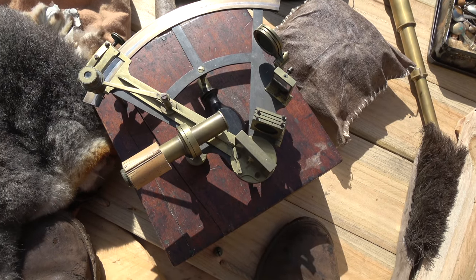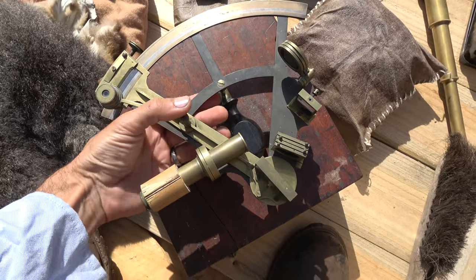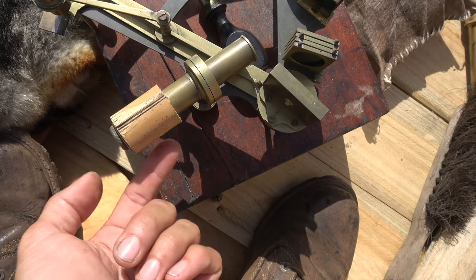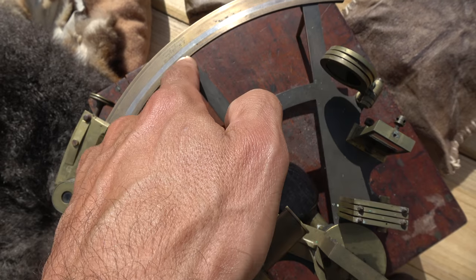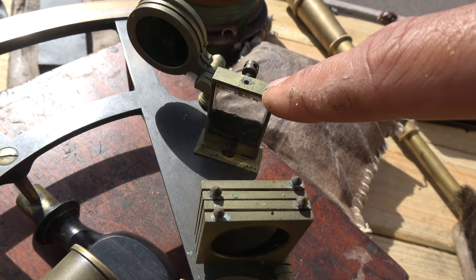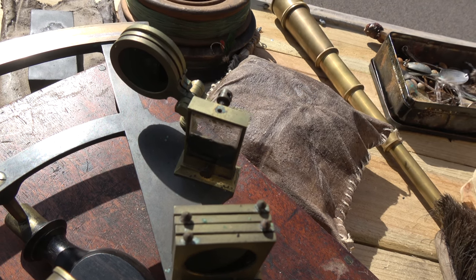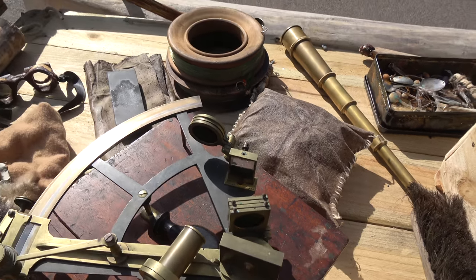This is a sextant — a genuine 19th century sextant — which wasn't working when I bought it second hand. A couple of things were wrong with it. The focal length was incorrect, so I ended up improvising an extension to the focal length with a piece of bamboo, and it now works well. I had to clean off the measurements and also fix the sextant mirror, which was all degraded. I made an emergency fix using beeswax and charcoal, and I've got down to a mile accuracy with it.